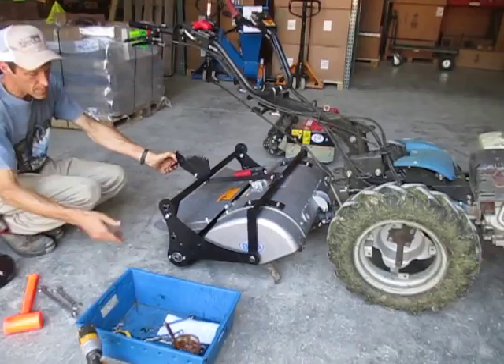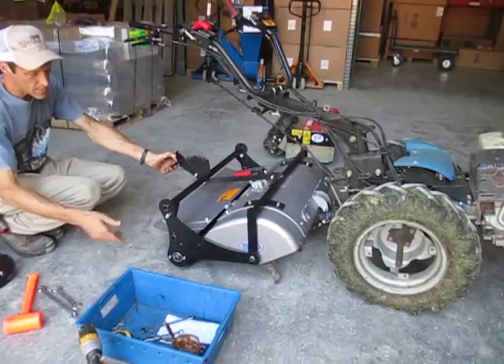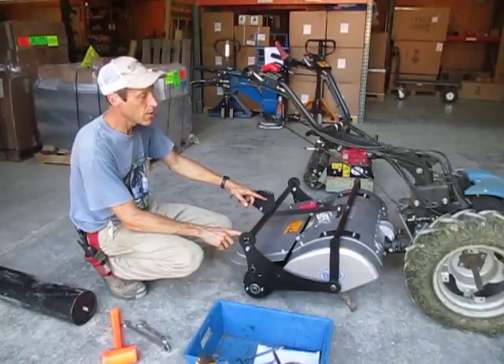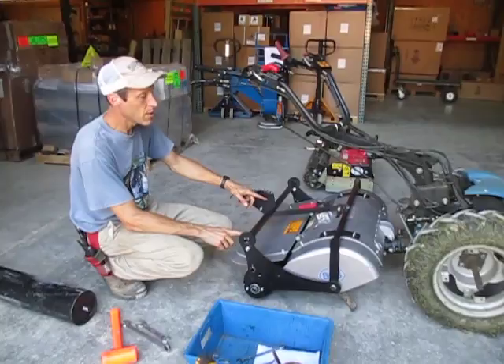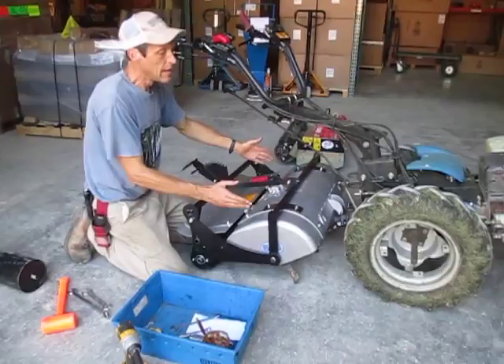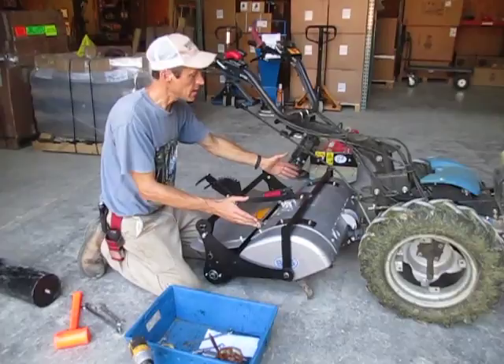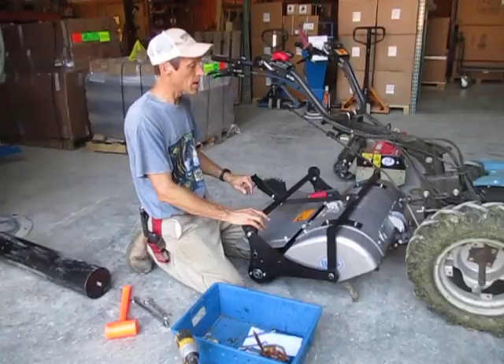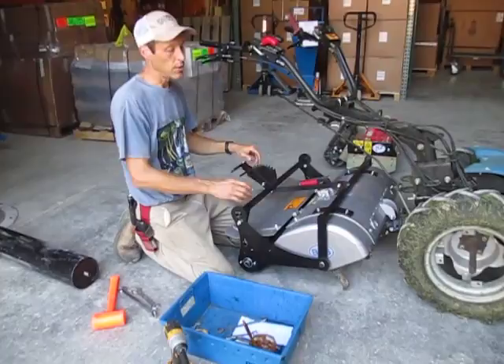Now we have the roller ready to go out and do some weed control. For weed control, you'll probably go very shallow — just a half inch or so — because you don't want to bring up extra weed seeds and make the problem worse. Just skim the top of the surface. This depth roller system is available for BCS 30-inch tillers in particular, which is what this is on, but it also fits the BCS 26-inch tiller. The inner bolt holes on the 30-inch are the outer bolt holes on the 26-inch, so you can mount this same frame to a 26-inch tiller, though the roller and frame will be 30 inches wide and stick out a little on the sides. We will also soon be offering this to fit the Grillo 27 and 30-inch tillers as well. Thanks for watching.